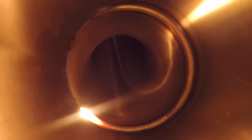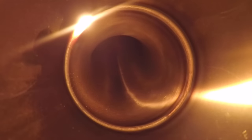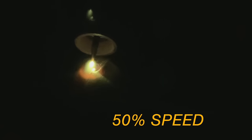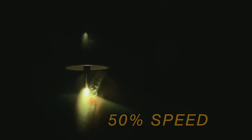The weld is a nice shade of gold — that's what you're looking for. The edges are a little dark on this one; darkness on the inside of a weld can happen for several reasons: not letting it purge long enough, not having a good seal on your purge, welding too cold which takes longer to get penetration and by the end you've cooked it, or welding too hot with not enough gas coverage. Most of the time you'll be running lift arc, so you need to know how to properly terminate your weld. If you pull your torch away from the puddle suddenly, it will oxidize leaving a crater and a pinhole. That's why we feather it out gradually — it's called a tail-off. You move faster and faster, pulling your tungsten away from the tubing as your puddle gets smaller and eventually disappears. That's when it's okay to pull your torch off.